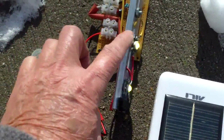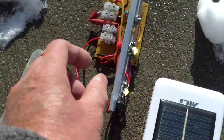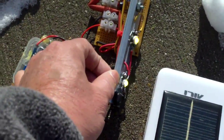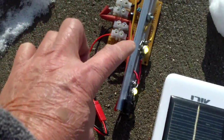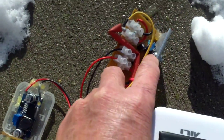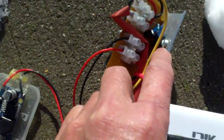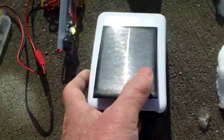It's not as efficient, like I said before, but it's okay. At one watt there's no heat at all — this heatsink would be completely cold. If you drive it at two watts then it will be slightly warm, so this amount of heatsink is okay for two watts, plus the heat sinking for the LM317.